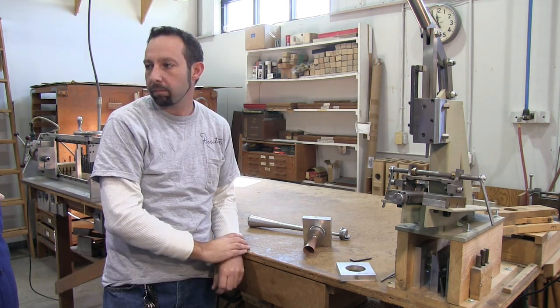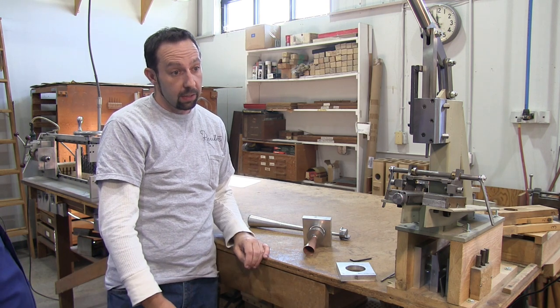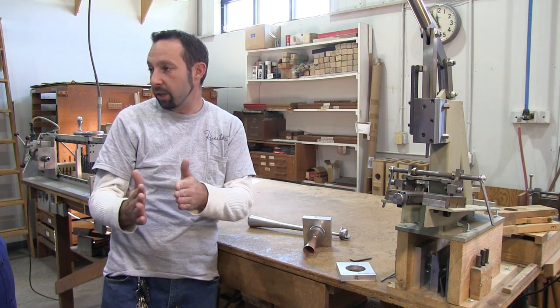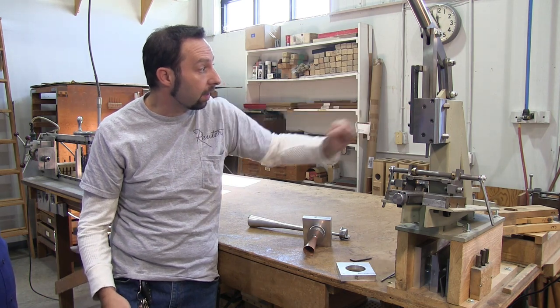Yep. And then the reed wires, do you make those? We do. We have a series of jigs. We have brass stock. We have a machine area where we just cut them to a certain length, and we have a series of four bending jigs that we use to make them, and we keep our sizes right over there.